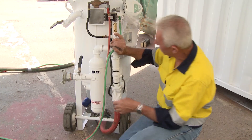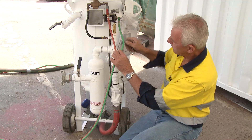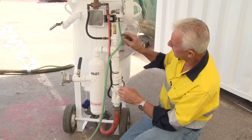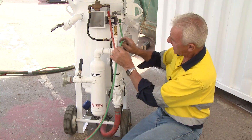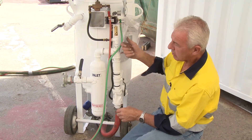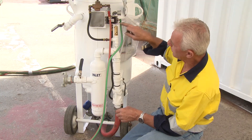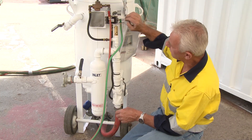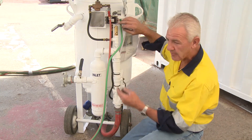Don't forget to let it breathe. Now, say for example one of these hoses didn't work properly — what's the consequence if one had a hole in it, a split in it? When the dead man is opened or operated, the signal can no longer be appreciated by this particular valve. So it becomes a confusing operation — it may not open properly, it may not open at all.